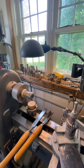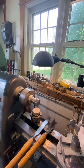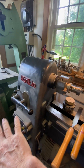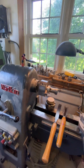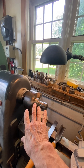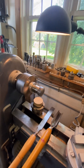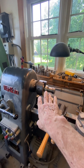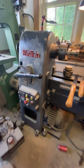What's good about the forward and reverse is I don't push stop to switch directions. I've programmed it so you can be in forward mode, push reverse, and it will handle the stopping automatically then go into reverse — no extra control needed. What's great is the braking can be balanced differently for forward and reverse, meaning I can set a different stop time for each direction. This matters because if you have a big piece on the lathe and a chuck, you sure don't want the inertia of that big piece spinning the chuck off its threads.